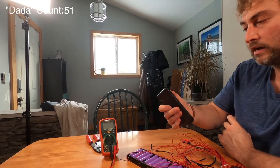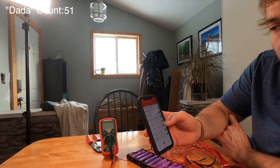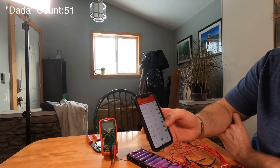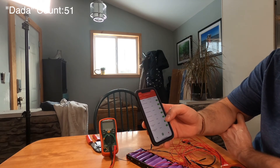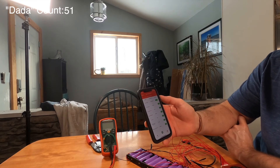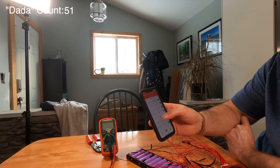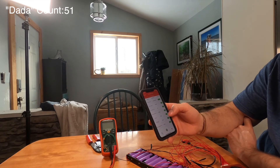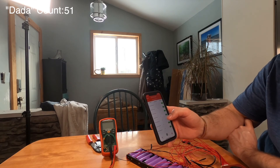Once you've clicked on the device, there is a preferences tab at the bottom which gives you the ability to change cell high volt protect, cell low volt protect, sum volt high protect, sum volt low protect, difference of cells protect, over charge, charge over current protection, discharge over current protection, and you can choose the battery type, rated capacity of the pack, cell preference, sleep waiting time, battery gauge state of charge.